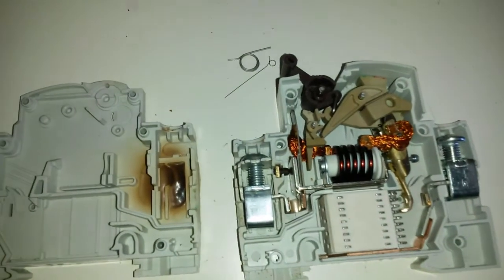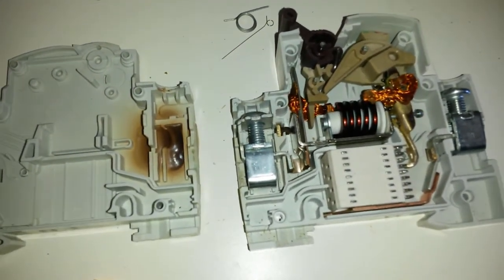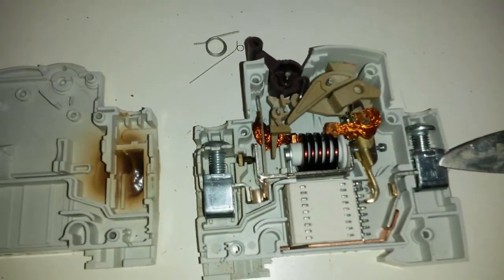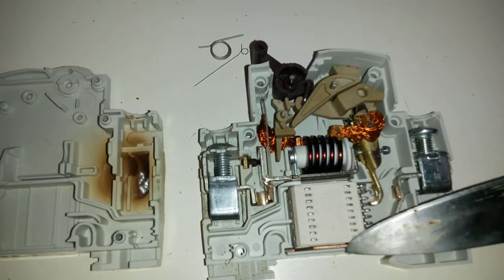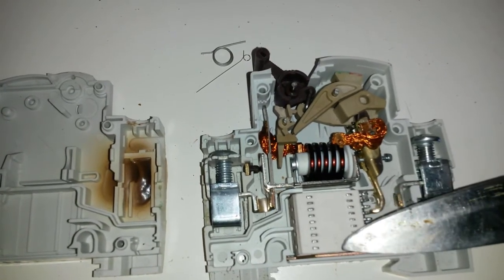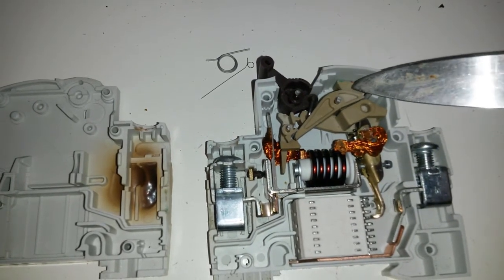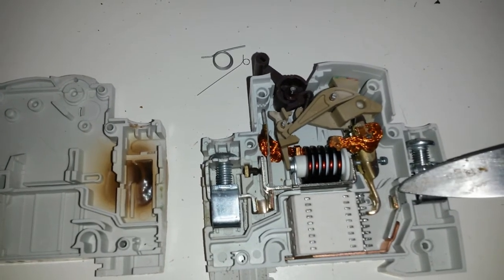Okay. It all fell apart as soon as I tried to pull it. Two springs came out, no good. But as we can clearly see here, this is a lug for basically plugging on the bus bar. It comes down here, it's resistance welded to a piece of copper, and there's this mechanism here which I have not been able to figure out yet. This moves forward and touches here, which engages. When you pull this, that moves, changes the color, and moves this across here. So that's fine, that makes sense.